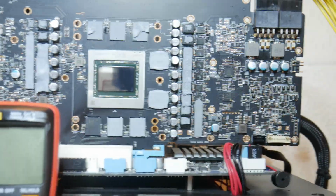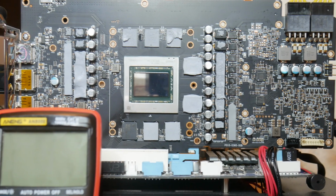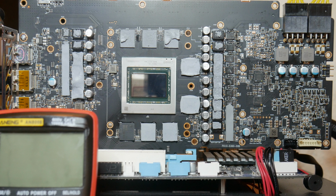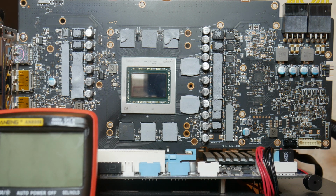And better yet, we have a BIOS splash screen. If you're wondering why the image looks corrupted, it's because I have a non-UEFI motherboard and it gives problems with modern AMD cards. But in either case, let's put the cooler back on and see if it does actually work, as there is a high chance that we have a dead memory module.